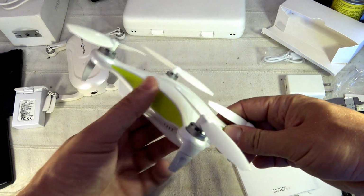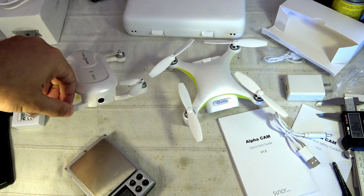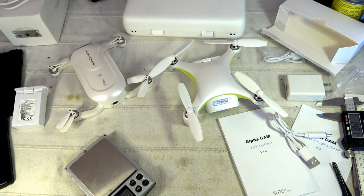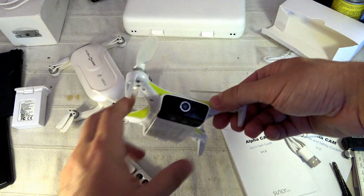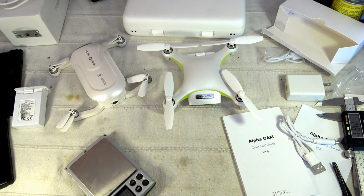What I can say about the camera is that we have a 13 megapixel sensor, and if you already saw some Zerotech Dobby with the electronic stabilization, you know that you can see some black border, according to the correction that is applied to stabilize the video. You can see some up and down black border. Here it's not the case because we have a larger field of view, and with electronic stabilization it will center the focus on the center region, and we don't see this black border anymore even with the electronic stabilization. That's great. So we will compare both electronic stabilization algorithms.